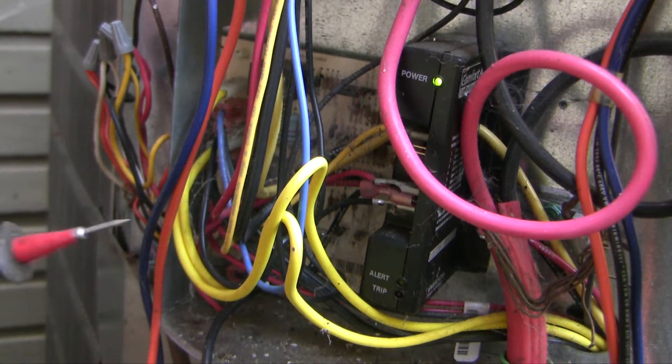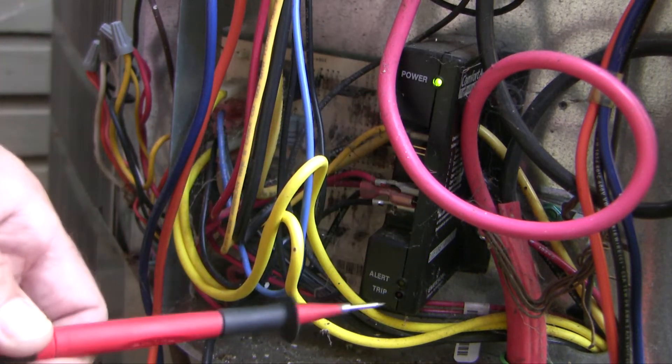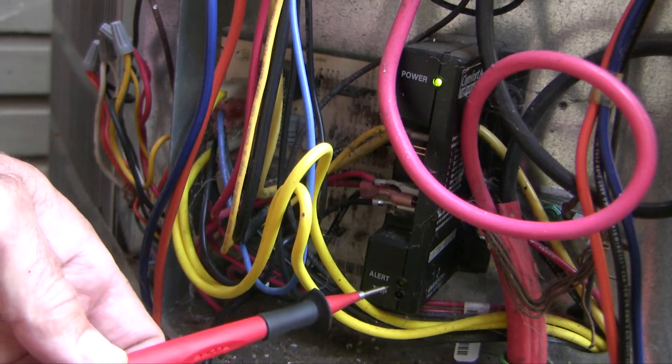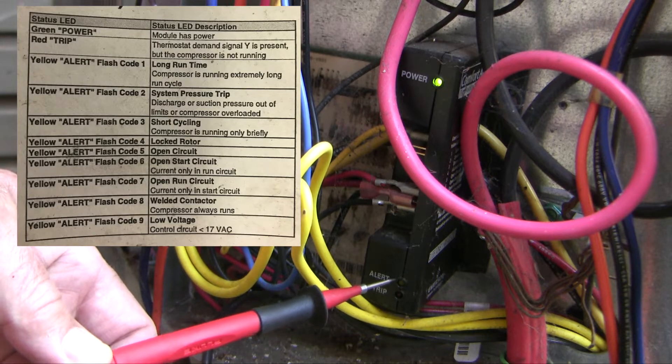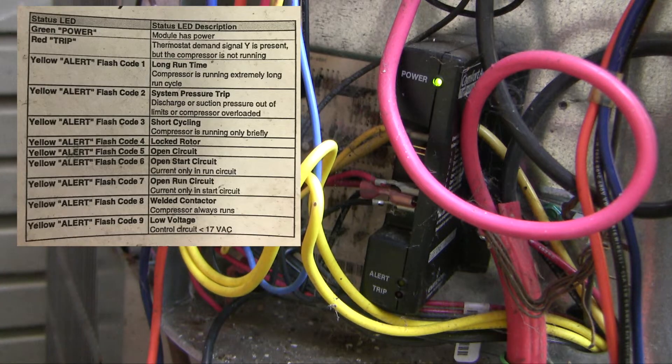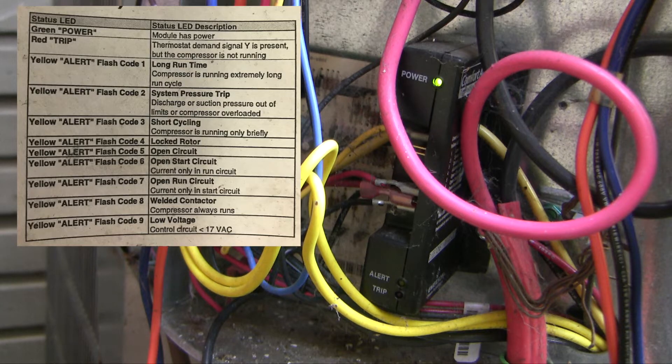The first major clue comes from the board — power is on and there's an alert flashing light. Counting the flashes, I get four yellow flashes. When I go to the legend beside the wiring diagram, it indicates a locked rotor, so it's evidently cutting out because of excessive amperage. Let's try and verify that.